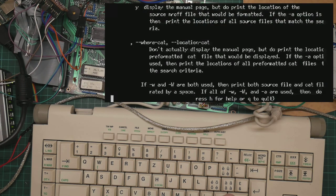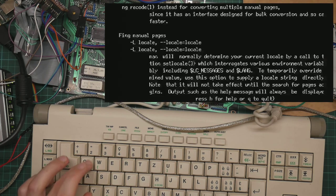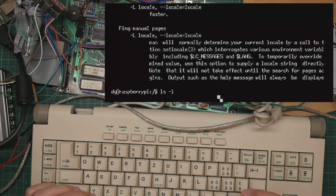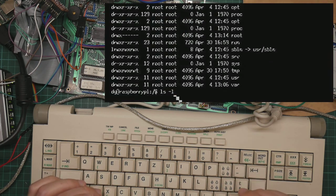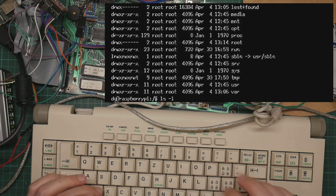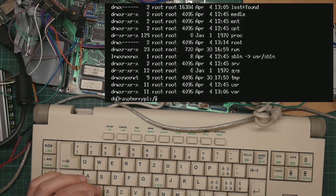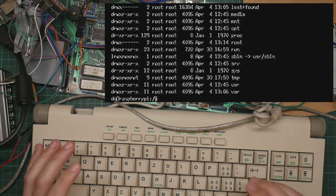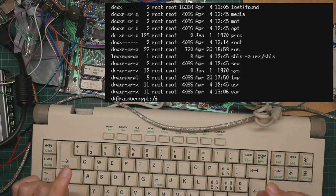I mean, it's producing correct results. It's just not a very nice user experience. So in fact, we want to prioritize redrawing the screen over running the TTY state machine. But we can do that by adding another ring buffer.